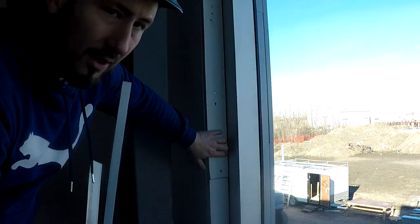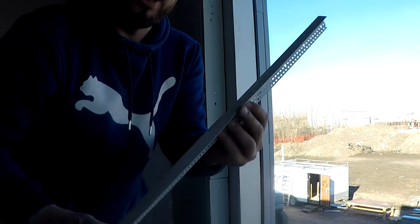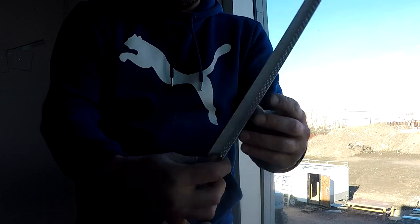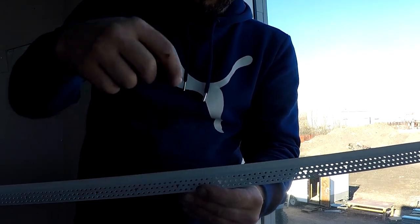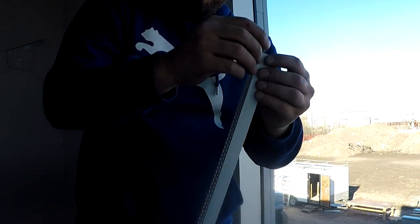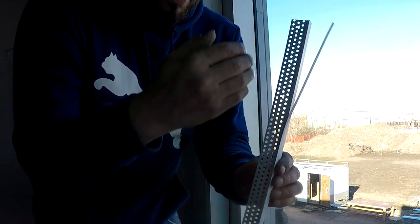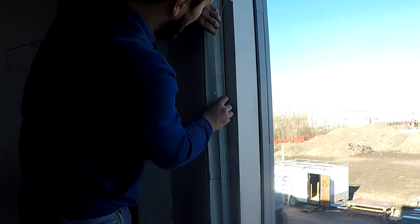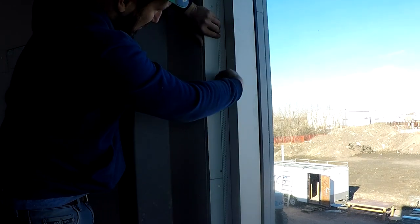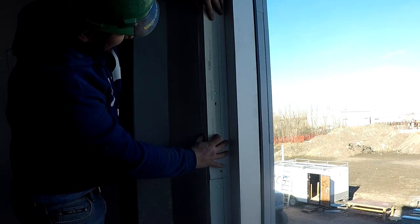The objective is to get the corner bead and the tear away onto the return properly. The tear away has three sides: a long side that goes along the drywall, a longer edge that goes inside the drywall itself, and this edge here that actually tears away — hence the name — after the tape is on the mud. That's why we leave a quarter-inch gap so it can go in tight, and then the taper muds it.